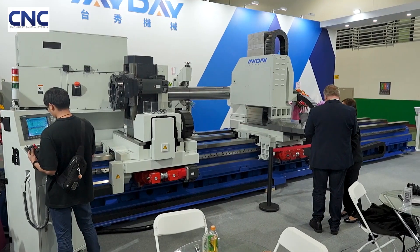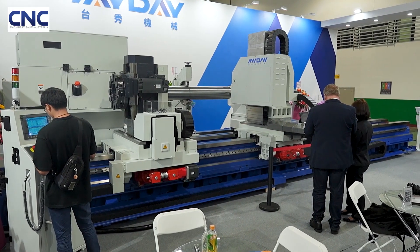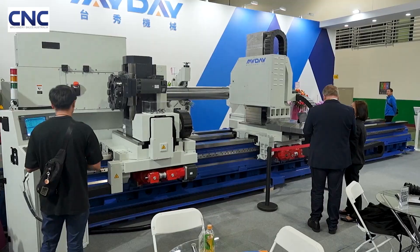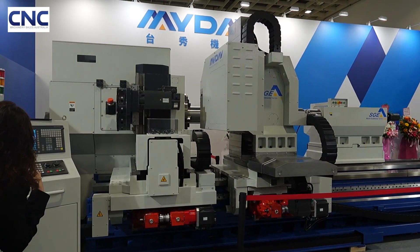So first of all, the main idea is we could make it a dual carriage machine — a machine with two carriages. But two carriages may interfere with each other in terms of stroke. So we have a special design at the headstock side, where the first carriage on the left-hand side can park aside the headstock. In that case, the second carriage will have almost full stroke toward the headstock. And vice versa, the second carriage can park aside the tailstock, so the first carriage will have full stroke. So we make two carriages work independently, but with full strokes.